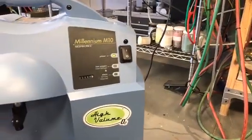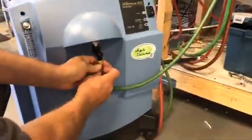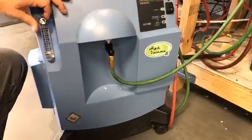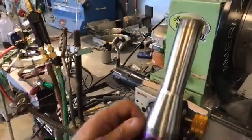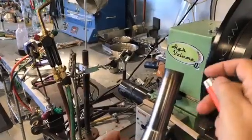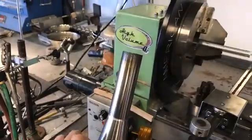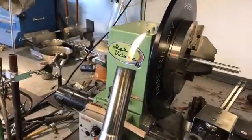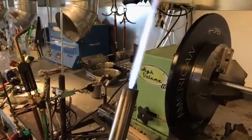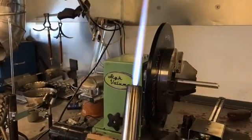There are a few things you want to keep in mind. I've unscrewed the line that goes to my Lynx Centerfire and I'm just going to screw this directly in — straight to my Lynx — turn it up as high as it will go, and now I've got oxygen blowing out. You want to leave it open; when you're using a concentrator you never want to close it down because concentrators don't like to be back-pressured. So that's telling me that's a good flame — that's what 93% looks like from one concentrator in the Lynx Centerfire.